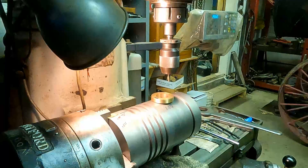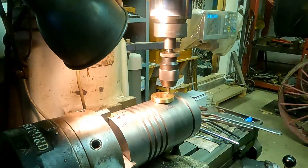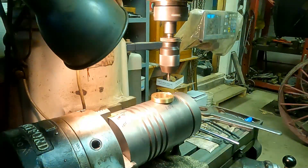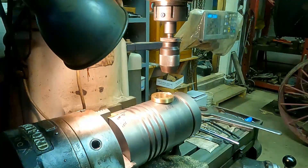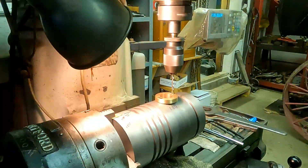Here we are back on the mill, back on the super spacer with the indexed part. I'm doing a center drill marking on this bushing — I installed it backwards here on the outside of the piston, but that's not the way it goes; it goes from the inside out. I need to drill some holes in this bushing and in the piston for a rod or pin that will be inserted from the inside. It will be half in the bushing and half in the piston, and that will keep that bushing from spinning in the piston. Starting out with a 3/16ths drill bit.